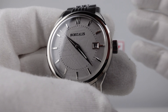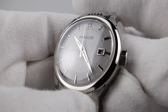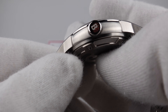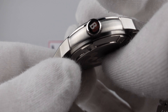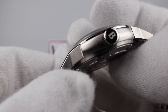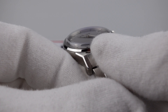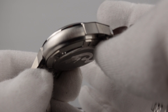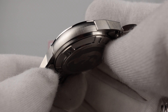The negative of the 8315 is that it does have a noisy rotor — that's a characteristic of all 8000 series Miyota calibres. The 8215 has the same issue. They have a uni-directional winding rotor, and when it spins to wind the movement you can hear the ball bearings in the ball race and the rotor spinning. You can hear it winding when on the wrist. The Miyota 9000 series, such as the 9015, doesn't have the same problem — they have a quieter rotor. The 9000 series is a premium grade.